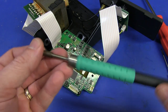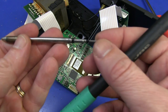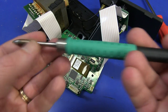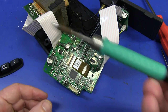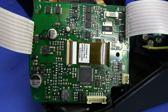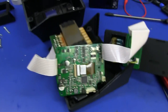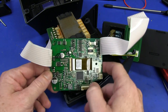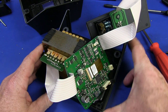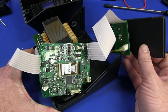One of the really neat things about this iron is that it has a thermocouple temperature sensor built right into the tip. That's why it's actually got three terminals there. It actually gives you the tip temperature display in real time directly on the LCD on the front panel. So that's fantastic. This will be one of the quickest teardowns in a long time — there's not much in it — but it is beautifully made. I am very impressed. It is first class design, quality, and construction, exactly what I expected in such a top-notch unit.